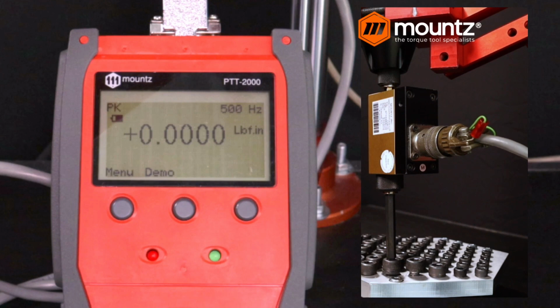Now, within the torque test or the tool test that we did, we do have the ability to have a green and red light notification. So that can be set up for that particular tool, and the operator or the tester just needs to look at the light to make sure that it's within the specs. And if it is, then they continue to move on. If they get a reading that's outside of that, then they can flag that tool to have that either looked at or recalibrated. So everything else is good to go here.